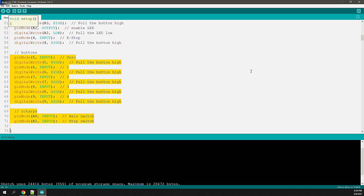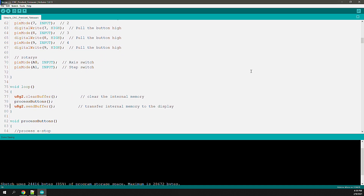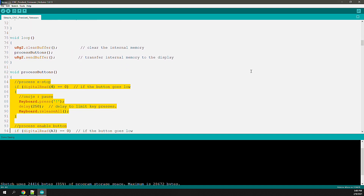Next is the loop function, called repeatedly as fast as it can while the device is running. The more logic you have in your loop, the longer it takes to execute before running another cycle. There's also system overhead the processor handles to keep everything happy. Our loop method looks simple because the libraries and subroutines are doing all the hard work — we simply clear the graphics buffer, process buttons, and write the results to the screen. The process buttons routine performs all the logic to send the right keystrokes to the machine, reading the pin states of each button and then optionally updating the display graphics or sending hotkey commands.